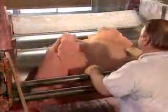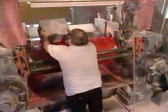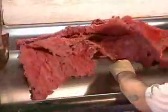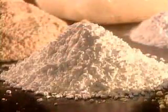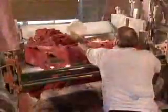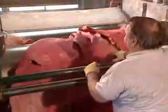They start by putting a batch of rubber into a mill. The rubber passes repeatedly between large heated rollers. They throw in any defective erasers from the last production run, recycling them into this new batch. Then they add sulfur as a curing agent, accelerators to help the sulfur do its job, and red coloring. They blend everything for 5 to 10 minutes until the mixture is the consistency of heavy dough.